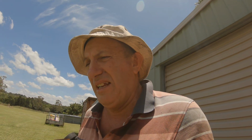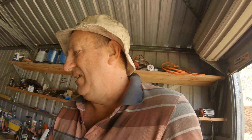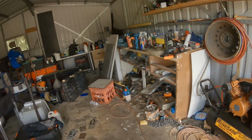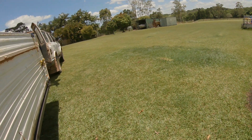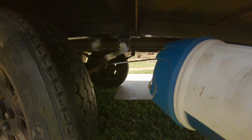But all right then. If you're doing any long distance travels and you've got a little old Jayco you've done up like this, or a little box trailer, I suggest for $11 each, get onto them boys and get them dropped off to you and put a set of decent ones on, because that's what snaps on 90% of them when you get on the corrugated road. They either come loose or snap them U-bolts, or the spring. They'll snap the spring. So if you go into your spring works, I know it costs a few dollars, you can buy special off-road ones from Elco. They make them. They're about $200, $300 a spring. They're a good spring. They've got rebound and everything.